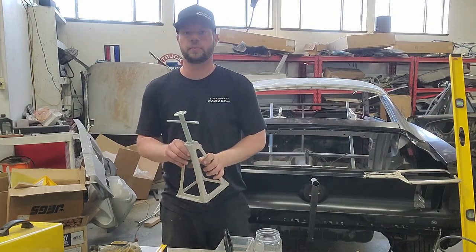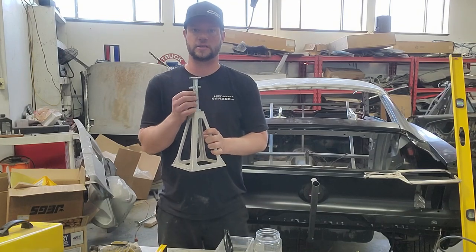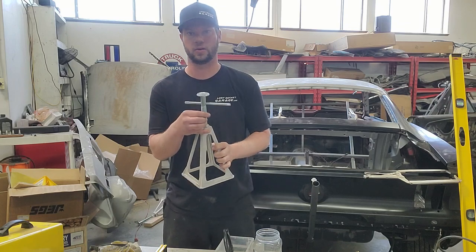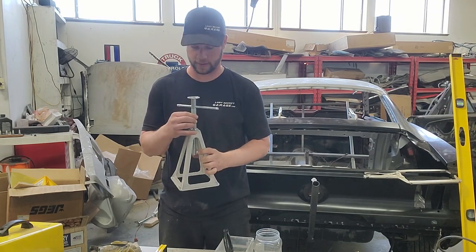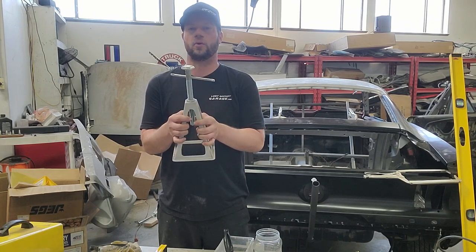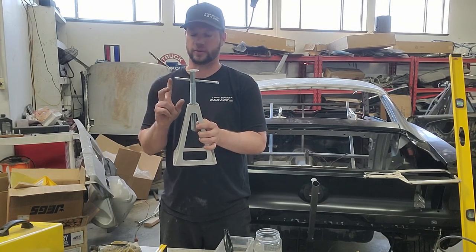Screw jacks are important because you can actually level it as it's on there, whether you need to make it go this way or that way, or front to back, or lower the back or front and everything like that. Very important. We typically have four on each side, two in the rear and two in the front.